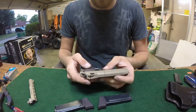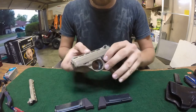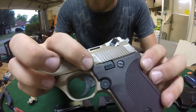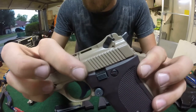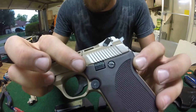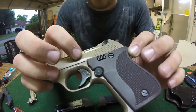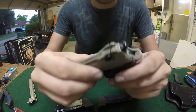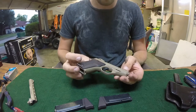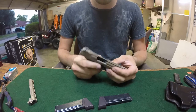There is one pin that always seems to work loose — it's right here, the forward-most pin in the grip. It'll actually start to work loose and come out, which pushes the grip out. I need to stake it — I think that'll keep it from happening. It does not have a last-round bolt hold open, but it's a pretty cool little gun.